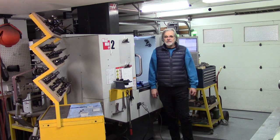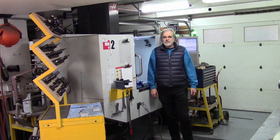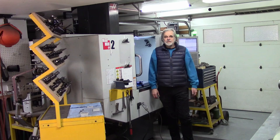and I'm going to be making the pieces for the sculpture base out of aluminum, and I'm going to be using the mini mill and the Bridgeport wherever it makes sense. In some cases, I've gotten so fast at programming the mini mill that I can get the job done in a short time, especially when there's tool changes involved. The Bridgeport, of course, has a power drawbar, but it's still a manual tool change, and every tool length would have to be calibrated.